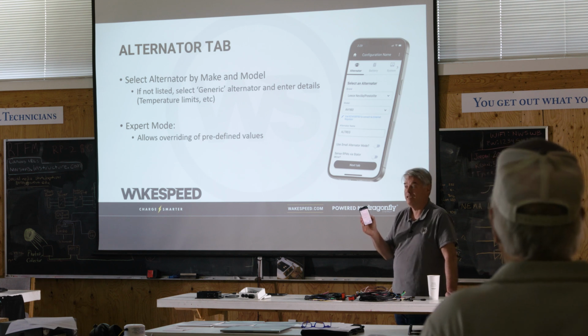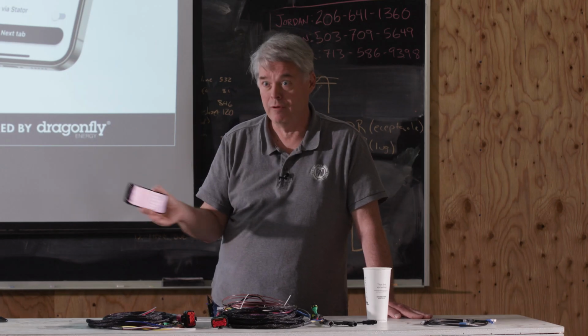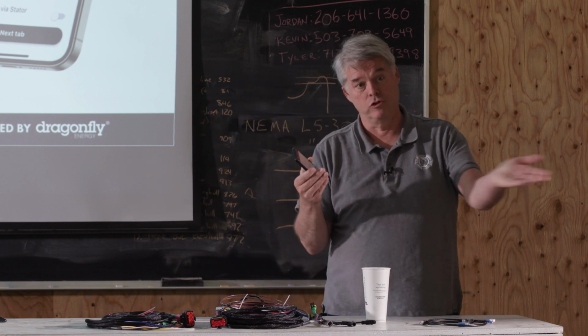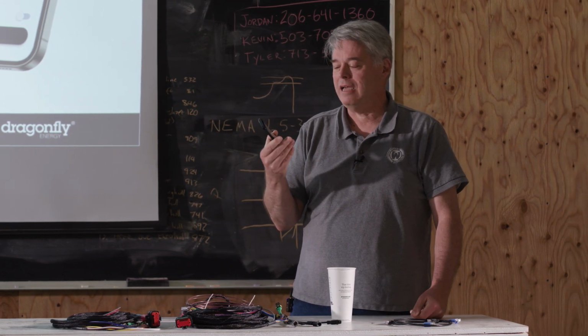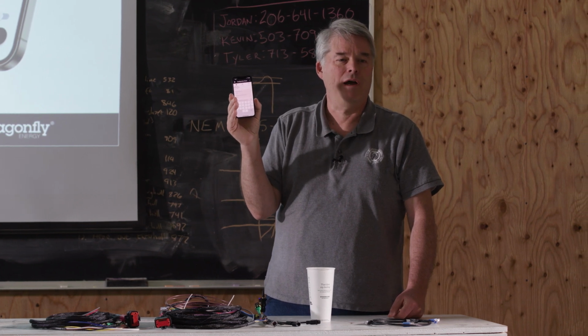I'll tell you another thing, that password comes out in the normal ASCII commands or in the normal ASCII status. If you take a log file, you'll see the password there, unless you put a dot in front of that name. Then that will be suppressed.